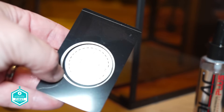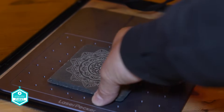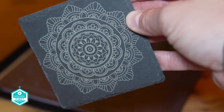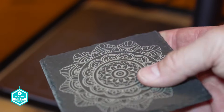What you don't want to be doing is melting things and causing chaos. I will circle back eventually to trying to engrave onto a pen, but I did go on to using slate, metal business cards, wood and plastic. You can achieve a range of results depending on the resolution settings — as you increase the numbers, you can have the resolution from 1k all the way up to 8k. Depending on what you do with that, the laser will run slower — if you have 8k, it would probably run eight times slower than at 1k. The desired result will vary dependent on speed, depth, and laser strength.